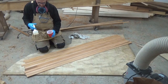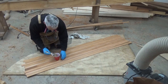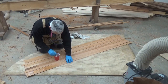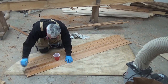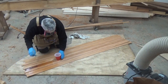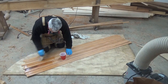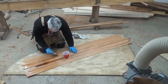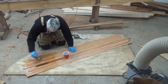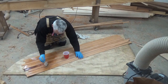I've laid out my laminations for the inside stem or apron. I'm just going to slap on a whole bunch of epoxy on both sides. I'm using West System 105 resin with 205 hardener. In this cup it's going to start to harden up fast, so I want to get it poured out and spread around — once it's spread out it's not going to kick off as fast.